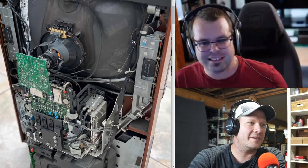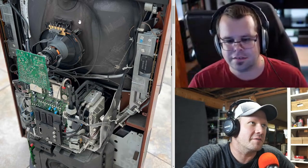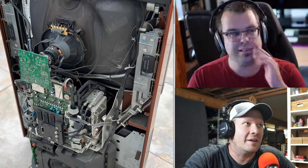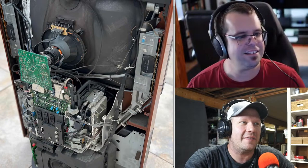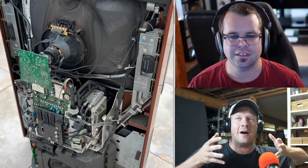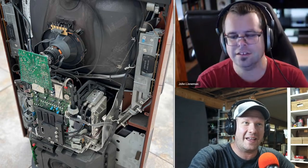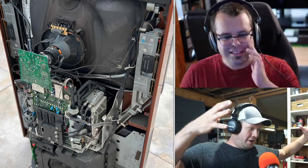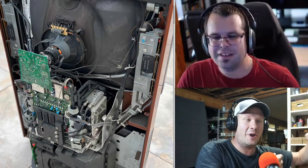But there is one thing I've learned over the years by servicing CRTs. There's generally a way to get like 90% of these clips out of the exterior, and then you can pull this whole board setup as one cluster out. And there's about five connection points. But the problem is you're pulling everything out then. But that way, I could safely set that whole cluster of massive boards down and slowly follow the manual to pull it all apart.